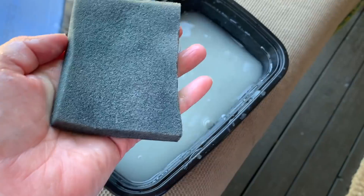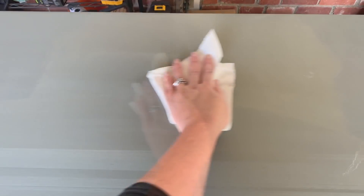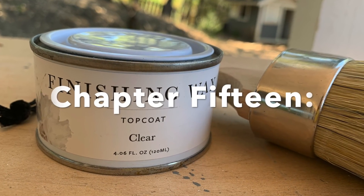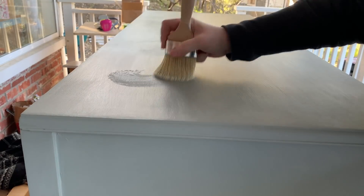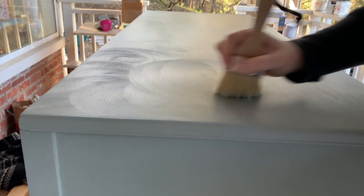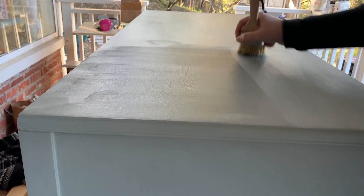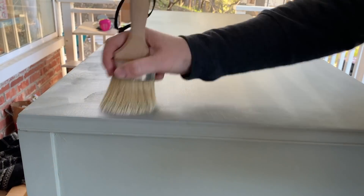Here is a beautiful subtle hint of a lavender garden. One finishing step I really love to do is to give my piece what's called a wet sand. This is not necessary, but this sanding technique of gently sanding over a wet surface with a fine grit paper carefully kicks off any little rough spots and it just leaves your piece with a silky smooth finish. You just wipe up with a lint-free cloth as you go and you can really feel the difference. Even though Fusion doesn't need a separate top coat, I decided to add a layer of wax — dressers get a lot of hands-on treatments so I knew the wax would be a good insurance policy, and I also just love how it deepens the color and adds a rich sheen. This is Jolie wax in clear, and using my big wax brush I worked in the wax and then wiped back any excess.